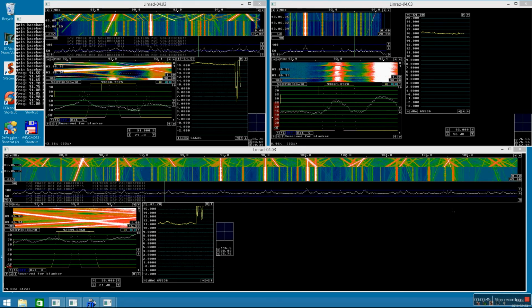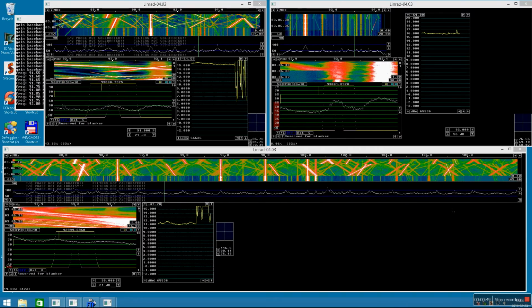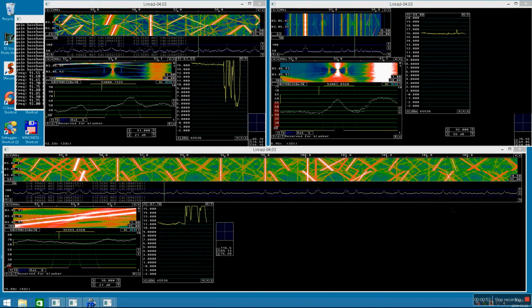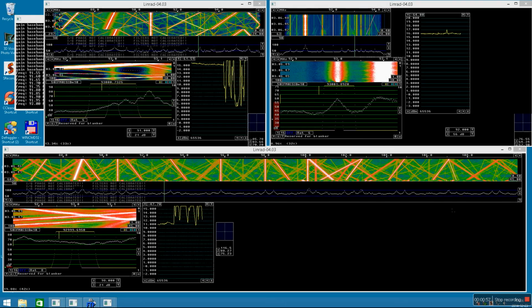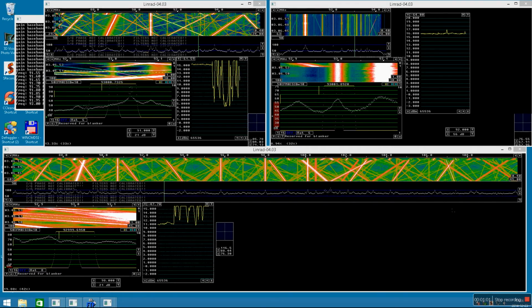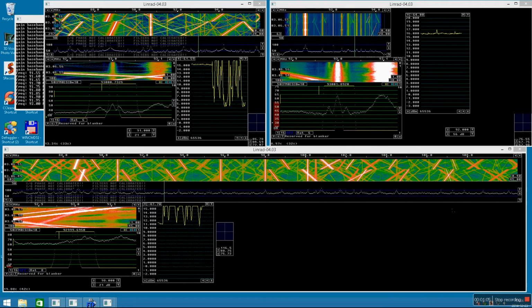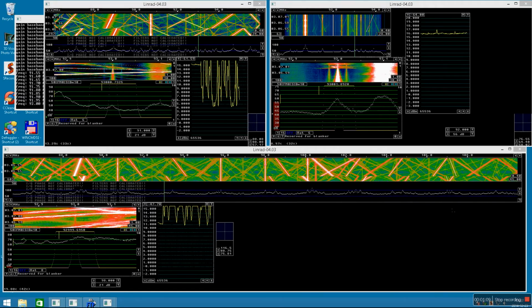And you can see on the other radios that this is a disaster. It does have an impact on the SDRplay also. But I could set the bandwidth smaller in this display and probably get rid of this problem. So wide bandwidth has a cost. The strong signals are let through all the way to the AD converter.